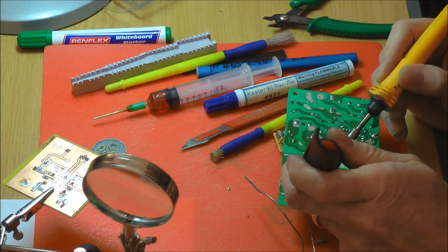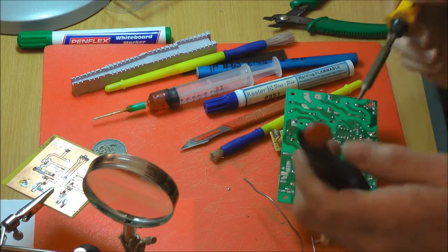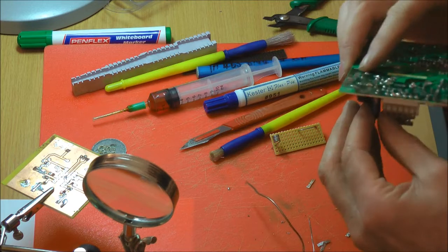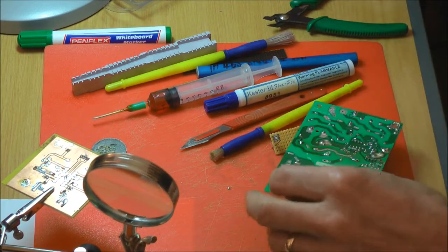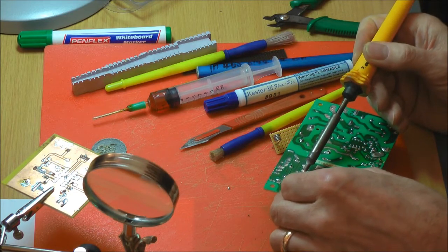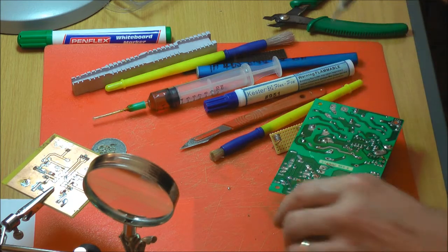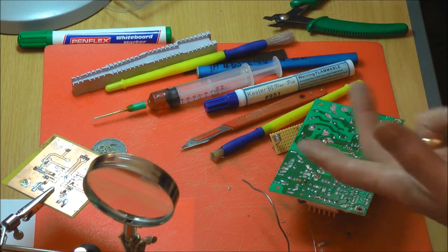Yeah. Having used a continuous pumping one, they bring problems of their own, particularly with through-plated holes. I found that, especially if you're worried about overheating the component, it really matters having the right size of bore and bit. Then you've got to work it round and round, and hope you can pick off the last bit.